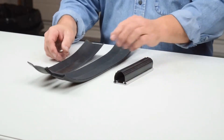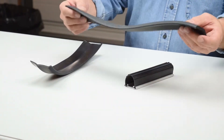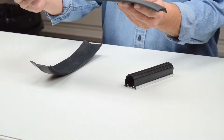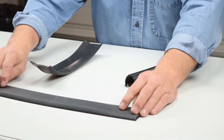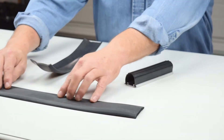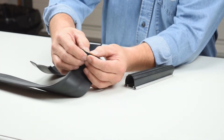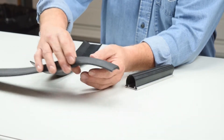We carry three different options. This is your common wood door weather seal. This part here is nailed to the bottom of the door. This is a soft sponge product. It's nice in that it will lay down into some imperfections on the floor and it gives you a good seal. It's made of sponge — there's rubber and vinyl mixed in it, more rubber than vinyl. Very easy to install.